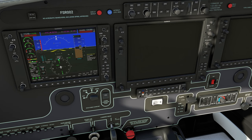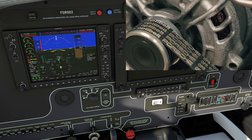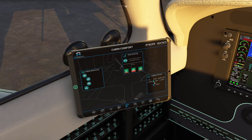A lot of people might say, well, why don't you just turn on the air conditioning — you've got the GPU connected. Well, in this aircraft the air conditioning compressor runs off a belt off the engine. So if the engine's not running, the air conditioner will not work. Over on the left-hand side of the tablet, here's where we can actually serve coffee, serve snacks, organize the pillows that may fall down off the benches in the back, and stow the pillows as well. The temperature is now dropping in the cabin, so I'm going to go ahead and close the cabin door.